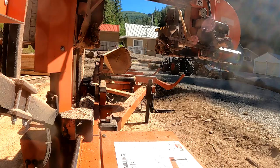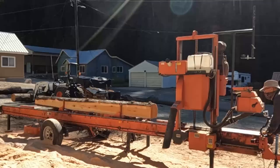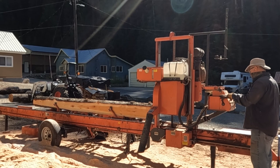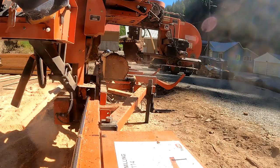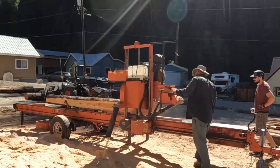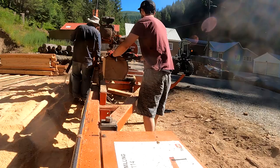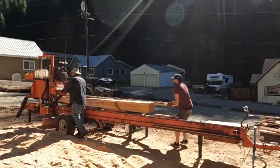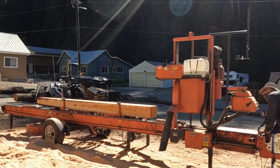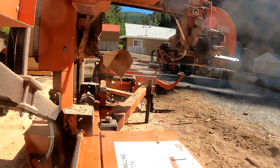And again, it's really important to put that stress in the log in such a way that when you're taking one bys off of this log, you want them to face bend. You don't want them to crown. It isn't that you can't mill out a crown later after it dries, but ideally you don't want to do that. If you're milling 1x6s full dimension like I was here, the customer wants as close to 6 inches as they can. So if you end up with a crown, which means that the log is bending to the side when it's laying flat, then he's going to have to edge that down. And sometimes you just can't avoid it depending on where you are in the log.